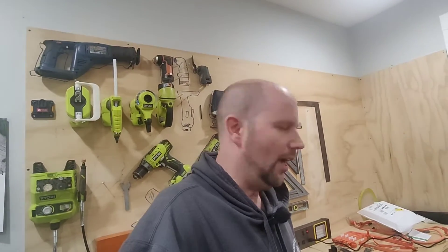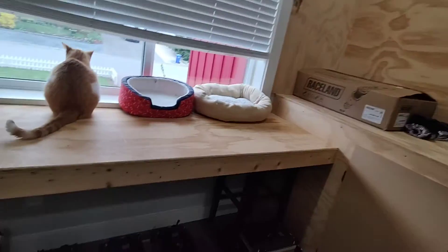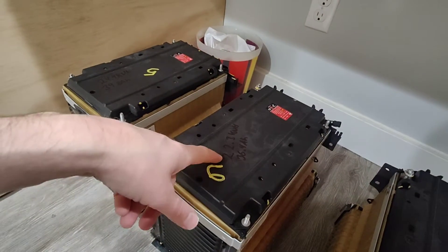After several days of charging and discharging, I now have all the figures. Most batteries are running down to pretty much the exact same amount. Batteries one through five all discharged 2,400 watt hours before I brought them down to 54 volts on each 60-volt pack — that's roughly 3.2 volts per cell — to protect them. So 2,400 watt hours out of each battery is pretty awesome. The only one that was less was module number six, which only got 2.23 kilowatt hours, or 36.4 amp hours.